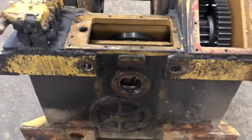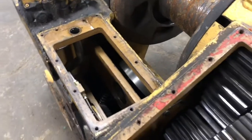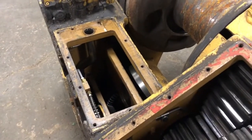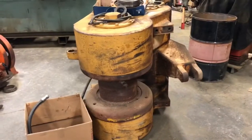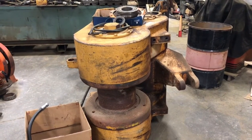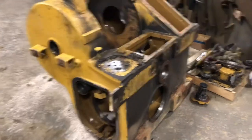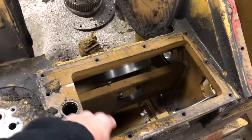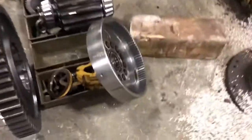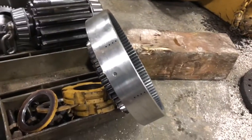It's a totally different design — rather than having a brake to one side and then a forward and reverse clutch, they lock up the forward and reverse as the brake, and then use the input clutch to bring power to the drum. The weak point of these winches is the input clutch. Here's that Cat 58 winch again — here is the input clutch housing, right there.